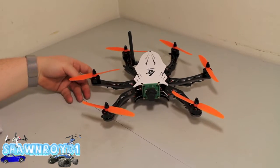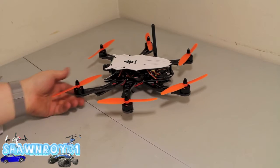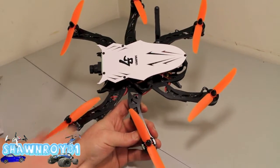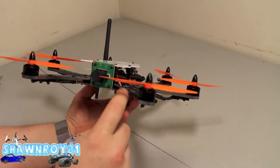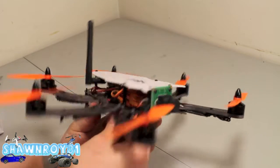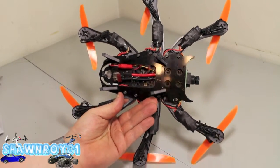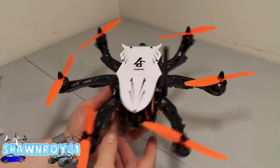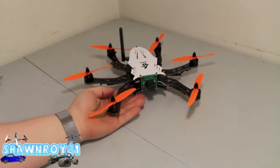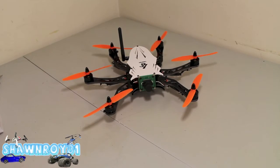There we are — not sure if I'm going to stick with the orange props. I relocated the antenna for the FPV — turned that transmitter sideways, it's the only option that gives enough room and clearance. It's zip tied underneath, nice and tight, and the antenna can only tilt side to side, which will still clear all the props. We have the CCD 800 TVL camera underneath, the Dean's connector, all wires nicely routed and zip tied — nothing loose or hanging to get caught in the props. Going to maiden this soon, so thanks for watching — please thumbs up and subscribe.